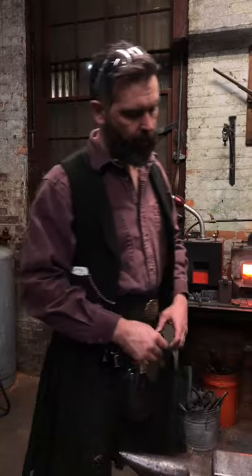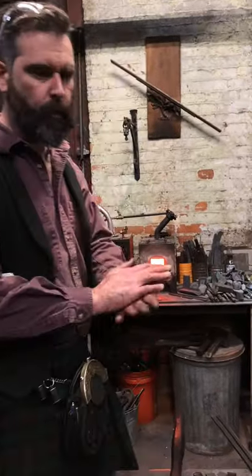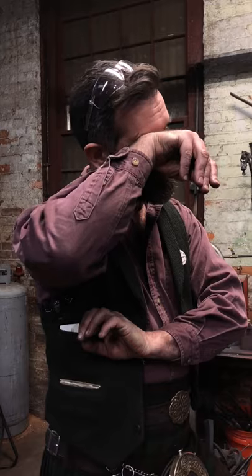Oh, there's a weird one here about heating up your quench oil. It's an interesting idea. Heat up your quench oil to 120 degrees, I think is what I've generally heard, and then quench your blades or whatever it might be always in oil that is 120 degrees. Well, from my understanding, certain polymers, I believe Parks 50 is one of them, when they get up to about 120 degrees, start becoming a little unstable in their quench, so they're not going to give you as good a result.